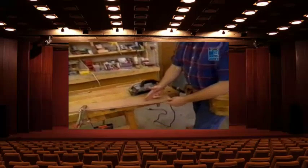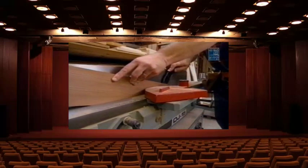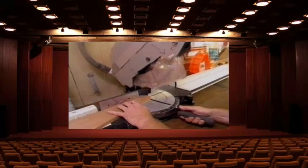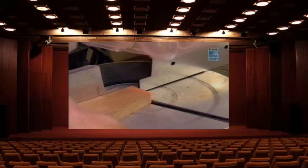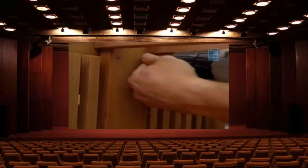I have to cut the end cap at a very long angle, so it's easy to do that with a small trim saw. I'll leave the line so that I can plane the cut smooth at the jointer. The last two cuts on this piece are on the ends at 12 and a half degrees. A few screws are all that are necessary to hold the end cap in place.